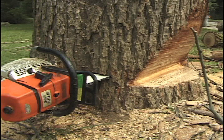One of the most important things to get down, though, is you have to be able to level that bar out and make sure your bar's plunged in there level, as there's a tendency for that tip to drop down. So when you're first starting to use plunge cuts, always double check. Just look at the tip of the bar and bring it up a little bit if it looks low to you. Being able to exactly hit the height of the back cut perfectly is very important in certain situations. Let's say the tree's growing on an angle, or the ground is sloping, or the saw's not cutting straight.